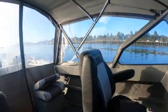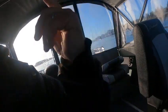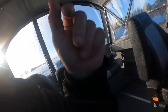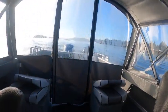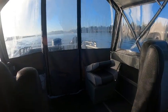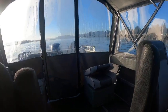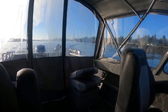You've got a sea cock valve back there. When the sea cock valve is like this, that means it's open - it'll let water in. If you turn the valve so the long part of the handle goes to the starboard side, that closes it. It was closed when I got in the boat, but it filled up with water, which was weird. I worked it back and forth and it seems to be working fine now. I think it was sticking partly open even though you thought it was closed.